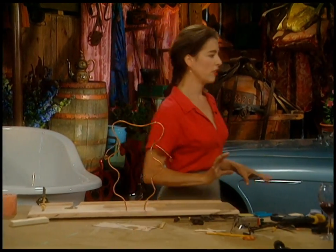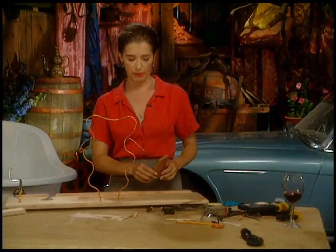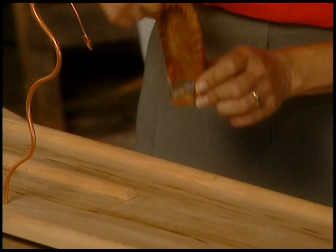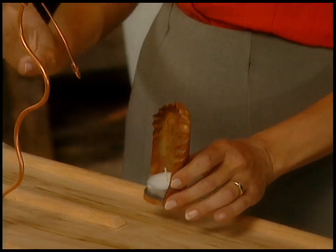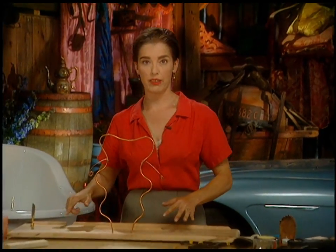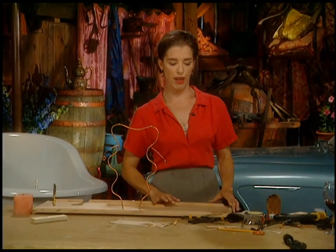If you don't have enough light in your bathtub area, you can just use an open candle, or you can go with this little one I just made out of copper — it shields you, it's like a footlight, because otherwise you've got the candlelight in your eyes and you're trying to read across it. I need to clear-coat this and I'm going to give it three whole coats of water-based urethane so that it really builds up, because you really want the board sealed — because if you don't seal it, it'll start to warp in the moist environment of the bathroom.